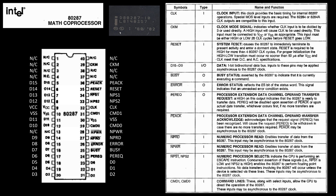Here is the table of the different pins and their functions. Some of this is pretty straightforward, like the clock - we're going to run the clock into this. CKM is a clock mode signal: basically, am I going to take that clock at full speed, or divide it by three and use a third of the clock speed? In my case, I'm going to pull that high so I just use the full clock speed. I'm not going for any high-speed records here, and I don't think I'm going to exceed the clock speed of this 10 MHz capable 287 coprocessor. My interrupt controller is actually going to be the bottleneck at this point - it's a slower version of that chip. I'm going to get a faster version later, but for now that is the slow part of my system, outside of maybe ROM or RAM.